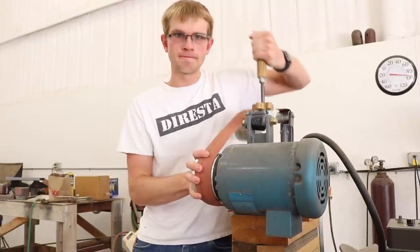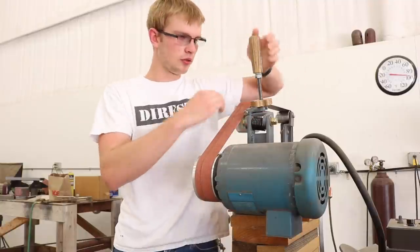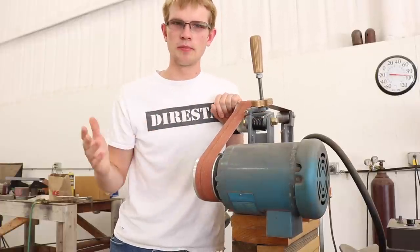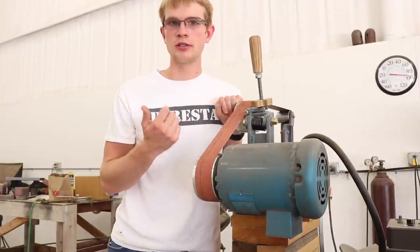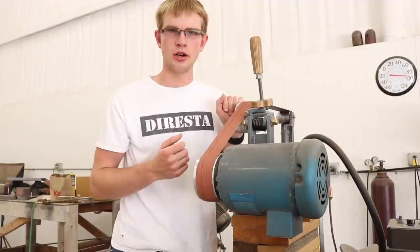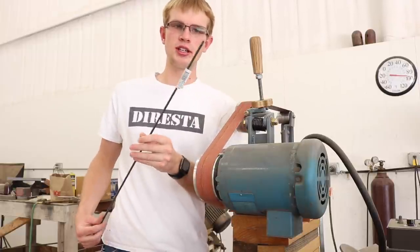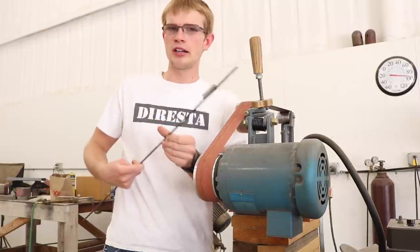The tensioner on my belt grinder uses a torsion spring that just twists up to lift the wheel and apply tension. When I built this I didn't know how much tension I would need, so I didn't want to buy a dozen different springs just to find out. I used a spring I could find around the place — a hay baler pickup finger. Since not everyone can find one of those, in the plans I said it's easy to bend a piece of music wire around a mandrel to make your own spring, so I'm going to demonstrate that.